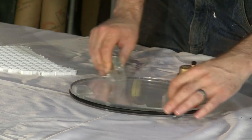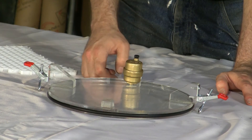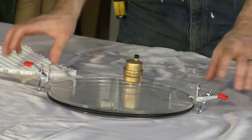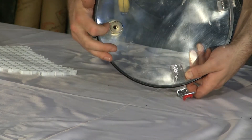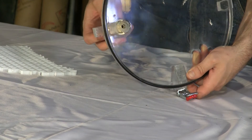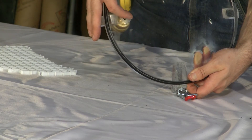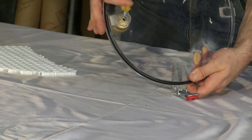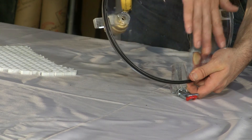The latches are screwed into two threaded holes. The Watts bleeder valve, which bleeds air out of the canister, uses a hole that was drilled and tapped for 1/8 inch pipe thread, and the valve is simply screwed right in and drawn tight. I also used a large drill bit run in partway to create a nice lead-in, which helps funnel the air to the valve and ensures we don't get any air pockets elsewhere.